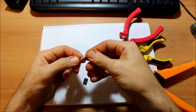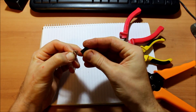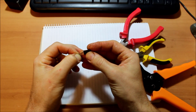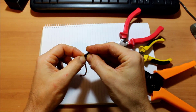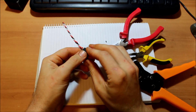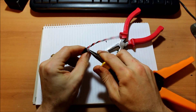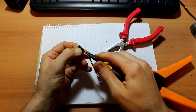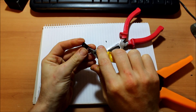Now you've got all of your wires and all of your connectors crimped into place, just re-twist the wires and get it all neat and all in the same orientation. Double check that you're putting the plug on in the right orientation as well — I'll do a nice close-up photo at the end to show you which order the colours go in. Then work them into their little slots like that, and you'll see I end up using the needle nose pliers just to help push them all the way in. You've just got to be reasonably gentle here because you don't want to damage the insulation on the wires.